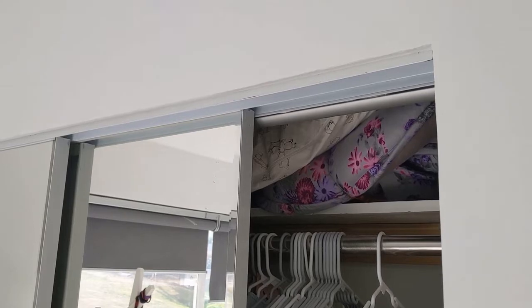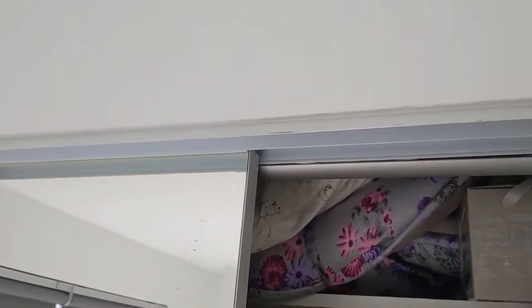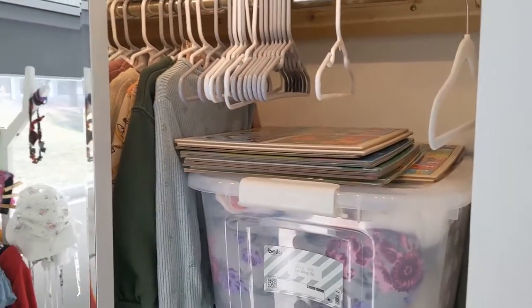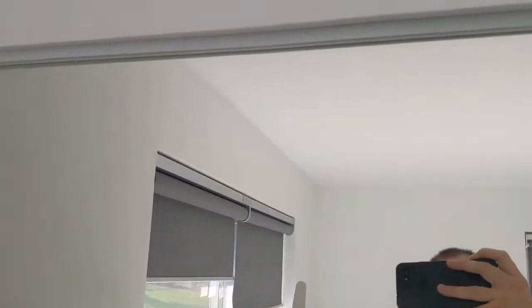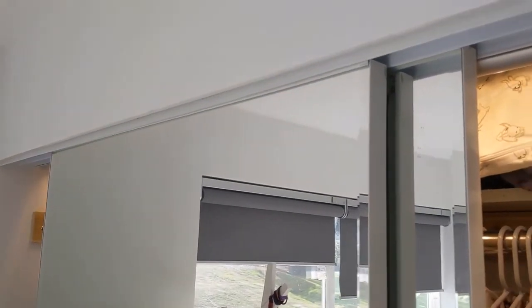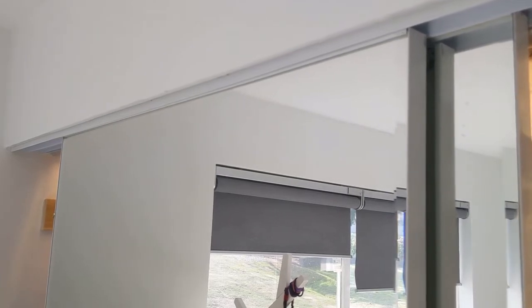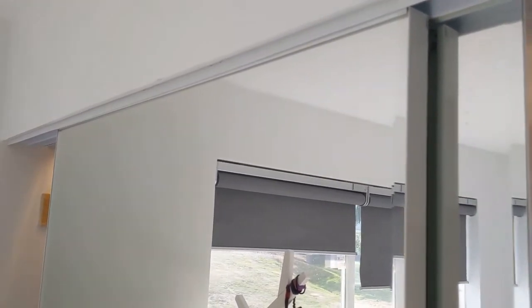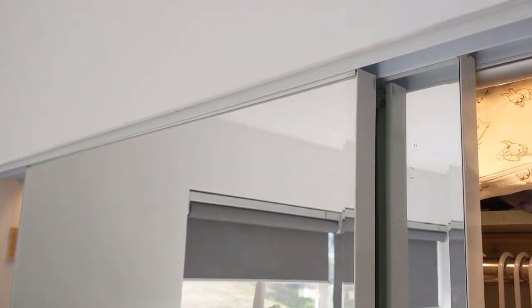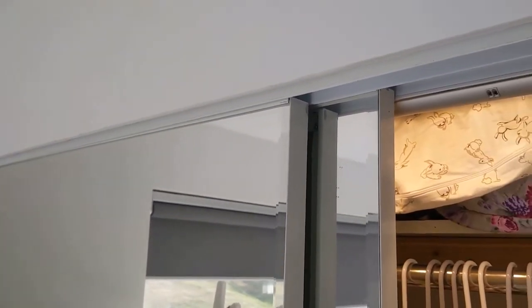This video shows you how to tie together two different NorFlies — the IKEA PAX lighting system lights that run off sensors. If you want them to run in AutoSense mode, they're nice to have. I installed them inside a regular closet with two lights tied together so either sensor controls both. The system has been retired, but the new version probably uses the same internals with the same sensors and microcontroller. The rest of the video shows you how to do this so you can tie them together and have the closet light go off a single trigger.